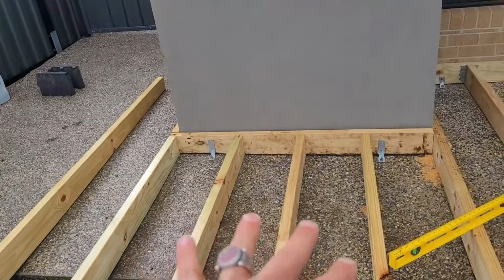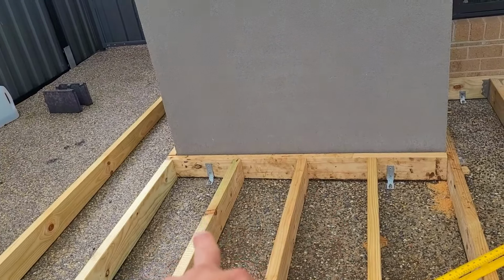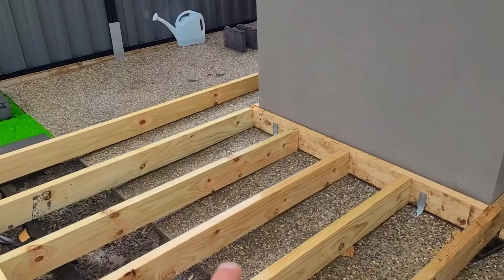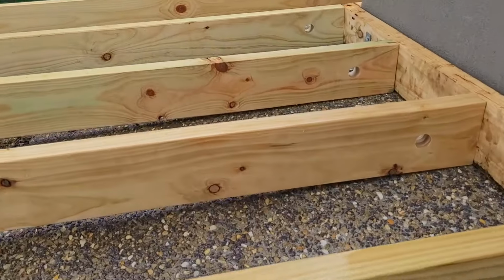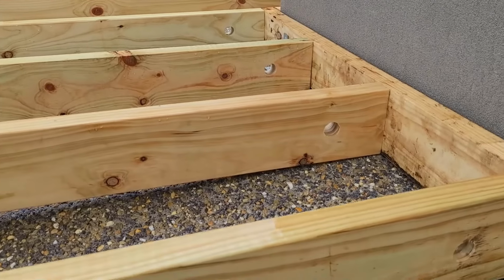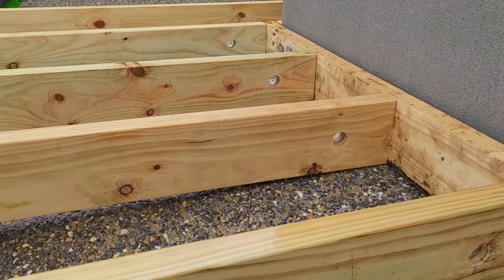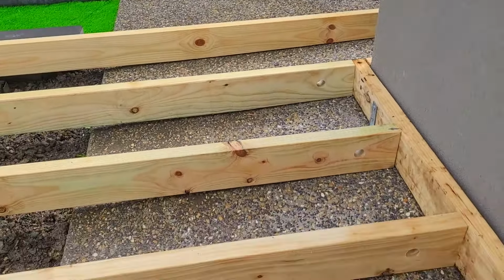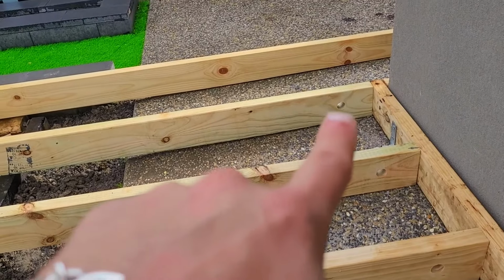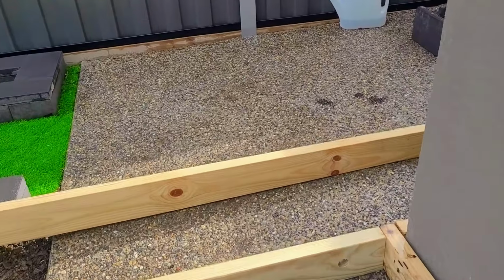But before making these 4 pieces attached to that joist, I just adjust those pieces because my surface is not level, as you can see. This main here, see, actually I removed some of the wood using the planer. So here, as you can see, the height of the joist is less on this side and it's getting bigger. Same is true for this one, the last one.